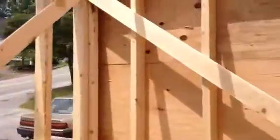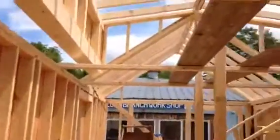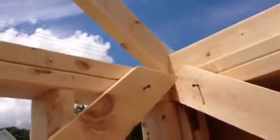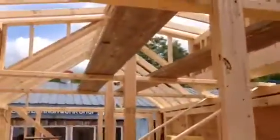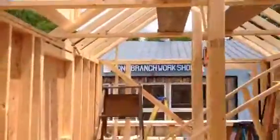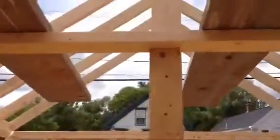And then to square up the roof, we went from the peak, you go from either peak, but we went from the far peak over there through the dormer to this corner. Took a measurement, then we went to that corner from the peak and took a measurement, and we found out what the difference was. Oh no, I'm wrong. We went from that peak, excuse me, to this corner after that. So from this peak to that corner, and then from this peak to that corner, and the difference was 3/8 of an inch.